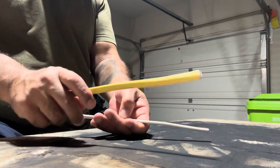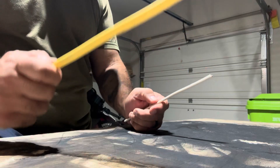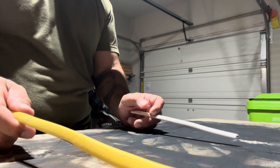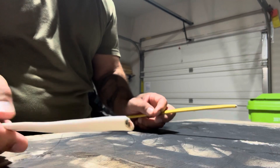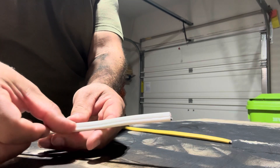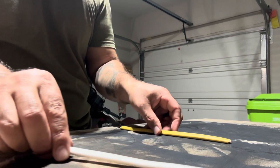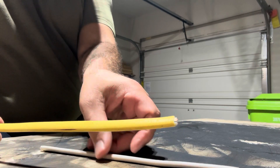To make it quick and easy, in most residential applications we're dealing with either 12 gauge or 14 gauge wire. The yellow jacketed wire is 12 gauge and the white jacketed wire is 14 gauge. It actually has the information imprinted on the jacket, but it's hard to see because it's imprinted in the same color. If you look closely you'll see it says AWG - American Wire Gauge - 12 gauge.